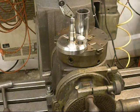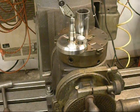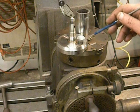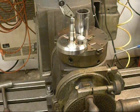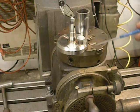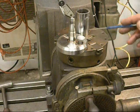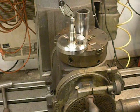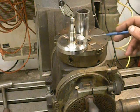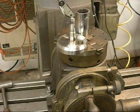This is the setup we're going to use. If this is the first video you're watching on this, we do a lot of work with crankshafts, but you have to be very, very accurate. We're going to bore this hole off-center by two and a half millimeters, or a hundred thousandths. Once we bore it off-center, we're going to start opening up the boring bar. That will leave approximately a two and a half millimeter wall for a bushing. We'll press the bushing in, TIG weld around it, bore the bushing, and put the pin back in - voila, stroked crankshaft.